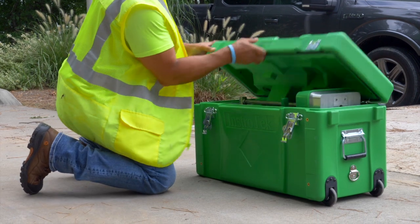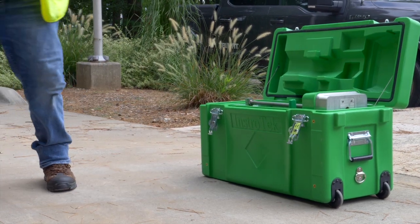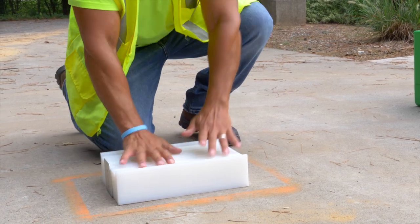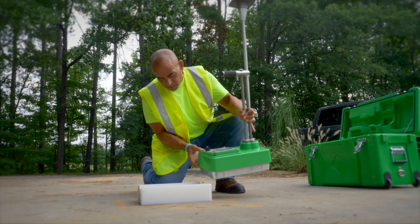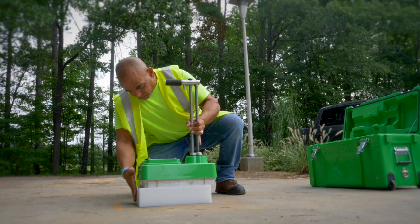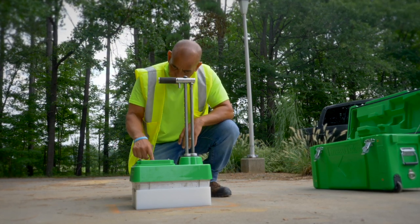Place the standard block on solid surfaces such as soil, asphalt, or concrete. Do not take standard counts on truck tailgates, tables, or non-solid floors. Keep the gauge bottom clean, rest it on the standard block, and check to be sure it is not resting on the raised edges of the block. Align the nose of the gauge with the keypad against the metal butt plate of the block.